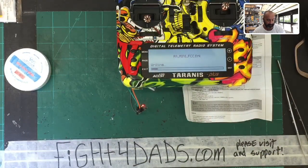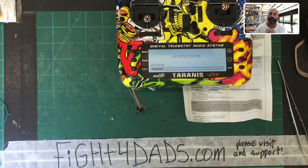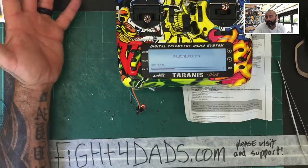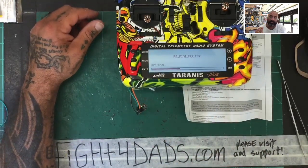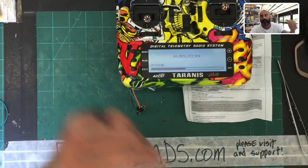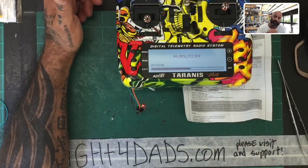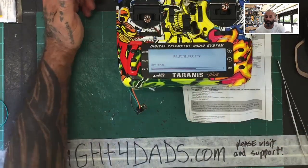Sorry, there was a little hiccup — I moved it. Don't move the cable while it's writing or you risk something like that happening. On your X9D Plus cable you will have positive, ground, and signal, and that's going to be different from the QX7 which is ground, positive, and signal. So as long as you know that you can make your own cable or swap them, or get one from me already configured. Also something that caught me off guard: the receiver was powering on before I even started writing, which I hadn't seen before.